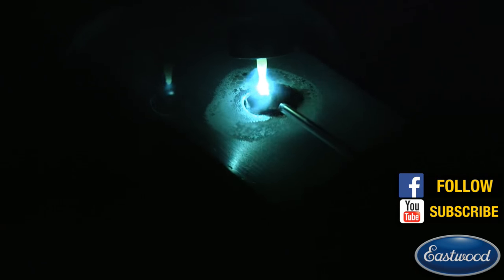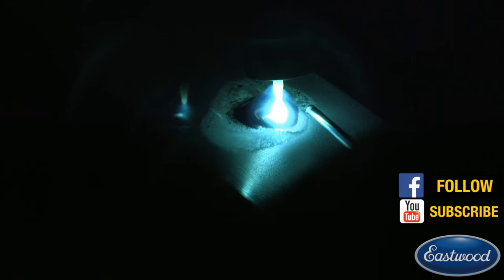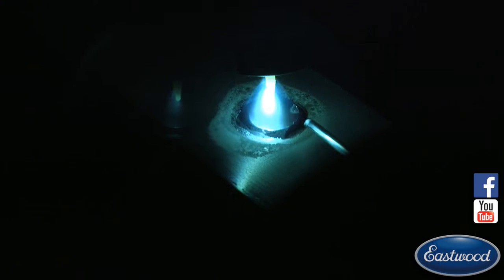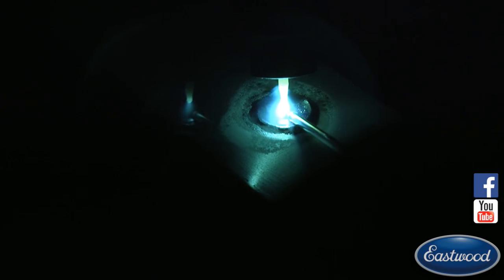Starting to melt it in. Now I'm going to start giving some more amperage. And I'm going to move that puddle over. I just moved it over. Moving it out. And just blending it in, filling the hole. Now I'm letting off. Put a little dab of filler.